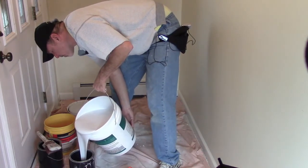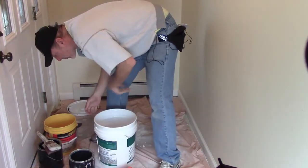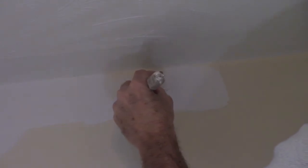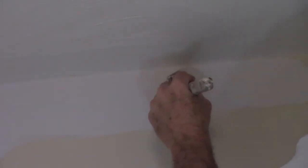Dump your paint into your paint tray and your work pot. Don't fill your work pot up too much because that'll just make your brush into a sloppy mess. As you're ready to cut in, you load your brush and then lay it out on the wall. Notice I'm using the brush flat — don't turn a brush sideways because you're defeating the purpose of having a big brush. You're turning a three-inch brush into basically a half-inch brush. Just lay the brush on the wall, flatten it out, and then sneak up on the corner.